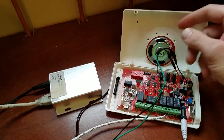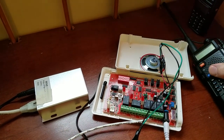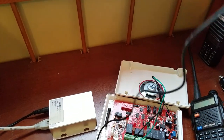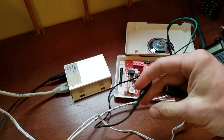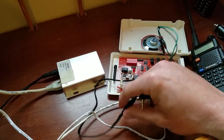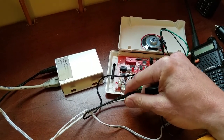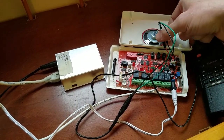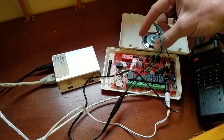How I have it wired: the speaker output from the receiver goes into the radio. The UV5R includes a headset cable with a speaker and earphone. I cut the cable right before the microphone. Inside the cable there are four wires — you want the red wire and the yellow wire. The red wire is your positive microphone input and the yellow wire is your negative microphone input. So you run the red wire to the red speaker wire and the yellow wire to the black one. It just gets wired directly, sending audio to the microphone input — the larger jack that plugs into the side of the radio.